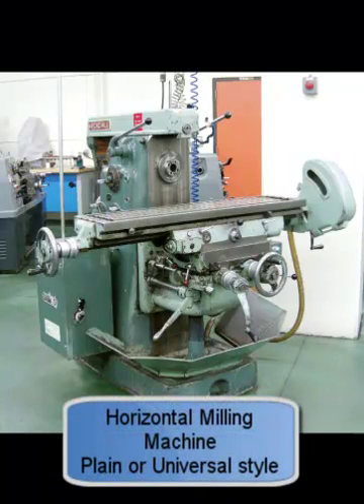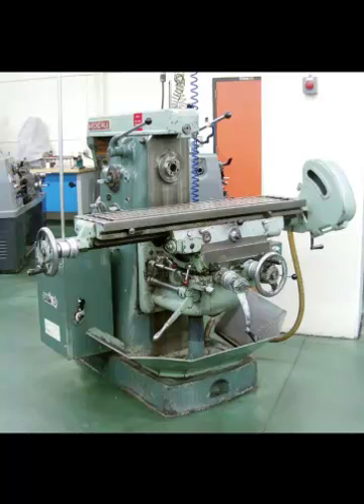This is a horizontal milling machine with a standard milling machine taper. It has all the features of the vertical milling machine but instead of a ram on top of the column it has an overarm, with an overarm support visible on the back of the column. When the overarm is extended towards the table, the overarm support goes on the end of that ram and an arbor is placed in the spindle — likely an A or B style arbor, though it could take a C style. The A and B style arbors are quite long and are supported both in the spindle and by the overarm support, with the cutter in the middle.